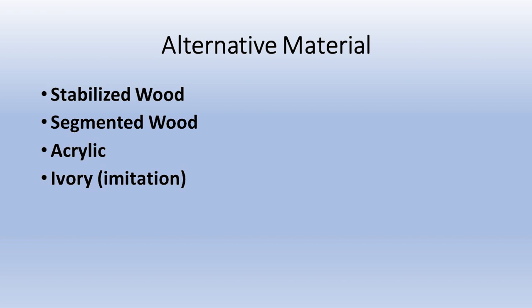Did you have to get extra careful when you did acrylic? Really slow? No, it's the same. What I'm going to talk about later is the TPI. I use a 16 TPI, which is the middle of the group, but acrylic is so dense and has no visible growth rings that you're better off going with a 20 TPI. It makes a cleaner cut.